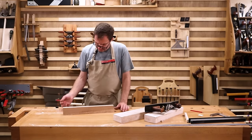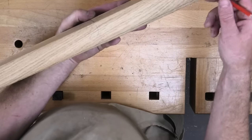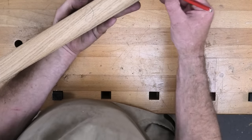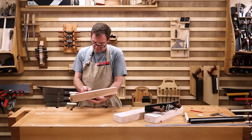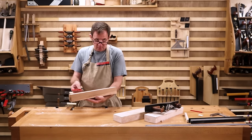Just looking at the timber now as well. Again, I expect we look on the overhead. Let's just see if we can get the grain direction here. These fibres are coming up that way. Look at this line here. I want to be now planing that way. If I plane against this, oh, it's coming out here, I'm going to push that round and break those fibres off. I want to be pushing down onto those.